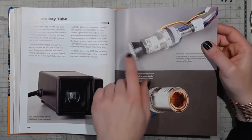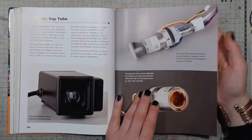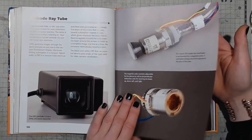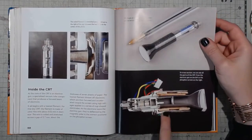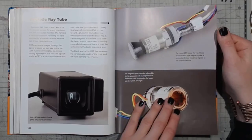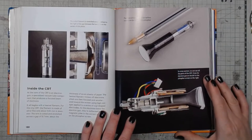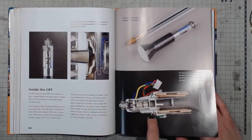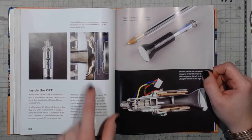I once saw one of those viewfinder CRTs live, and believe me, the way they managed to pack all the structure inside of it, it's magnificent. It's a thing of beauty and a joy forever. This is a larger one. Or maybe this is the same as we can see here? Looks like this is the same. It's how it's built. Then the deflection coils, horizontal and vertical, clearly visible. The Wehnelt cylinder, the cathode of the tube, the grids.